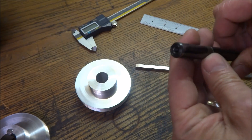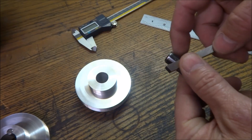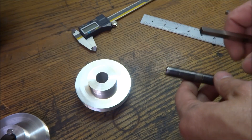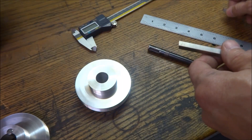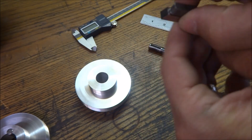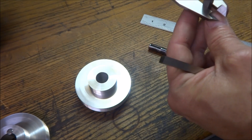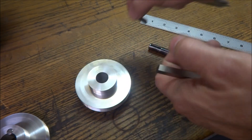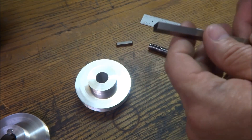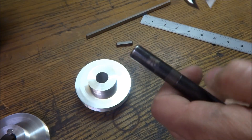Basically what I'm going to do is take this old shaft, bore a hole through it, slide this through, put in a set screw, cut it to length, and grind the end and see if I can come up with something that'll work. This is six millimeter high speed steel tool stock, and this keyway is 5.98mm, so that'll leave me a little bit of room to grind the sides and give it a little relief. First I just need to bore a hole down through here.